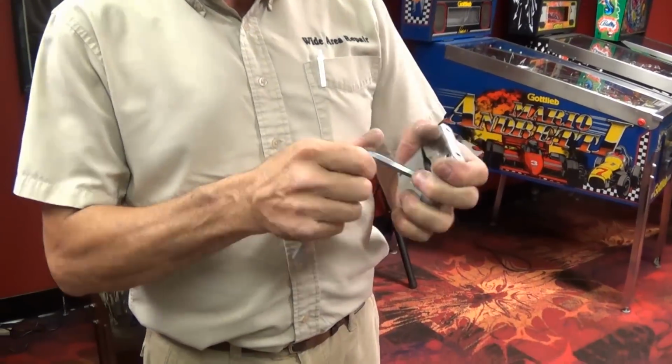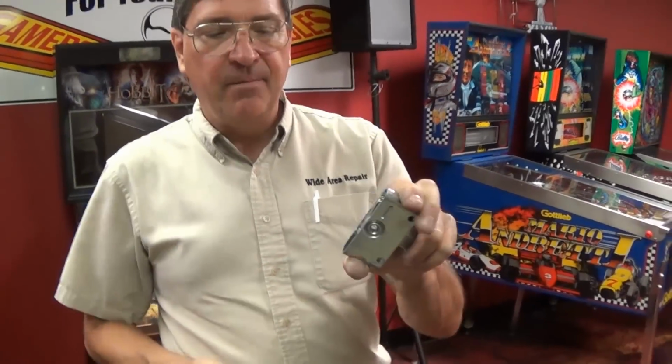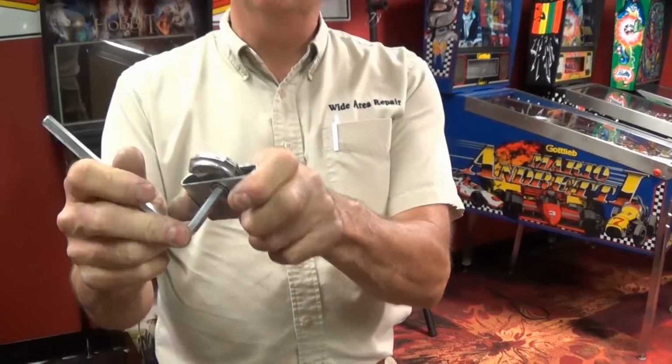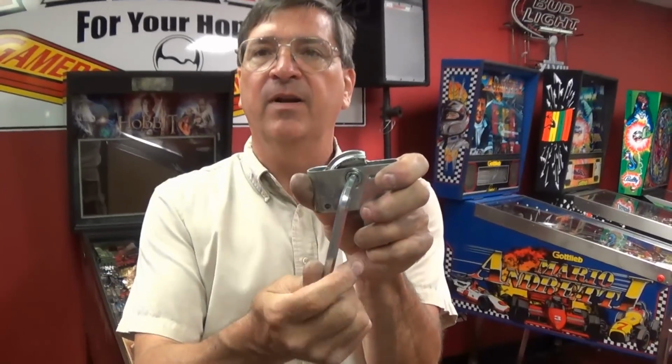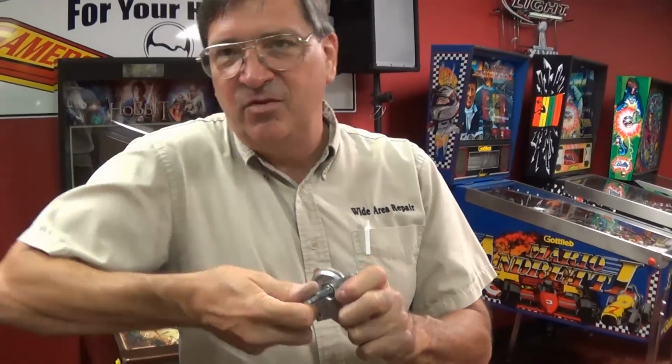Its upper and lower parts are bolted to the cabinet, and it is a 180 turn cam. This is the receiver part. The cam part is in here, which is the important part. Well, they're both important. This is what the device looks like. And you rotate it 180 and it locks on. It won't go any further. Yes. And it's an offset cam, so it pulls tighter as you go. That's how this works. And it hits a stop, so you know when you're tight. Yeah, you can't go all the way around. So that's nice. And that's what this looks like. And other than that, all the other steps are identical. Correct. That's the whole thing.